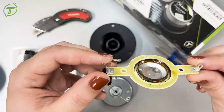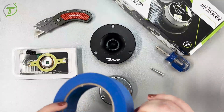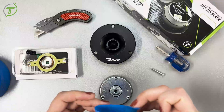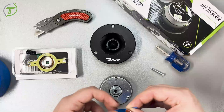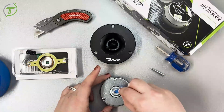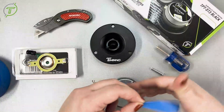The next step is to clean the debris out of the gap. Get a little piece of tape, fold it in half so you have adhesive on both sides. Try to get it thin so it can still fit in the gap and clean it very well. The reason we do this is because we must remove any leftover debris which can cause damage to your replacement diaphragm.